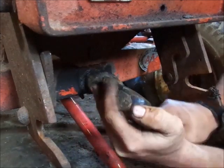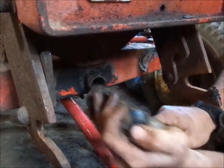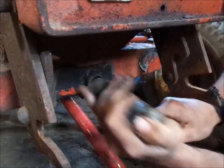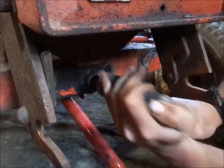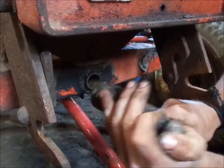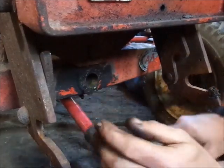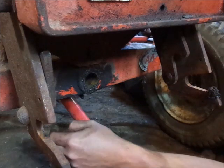It'd be nice to have a brass hammer or a rubber mallet to do this. One of them tools I don't exactly have, so just be kind of ginger putting them in, and it should be okay. A block of wood would be okay. As long as the bore is fairly clean, they should walk in there fairly easy. I'm just going to go flush with this. Just a hair more. Flush. So you guys get the idea there.